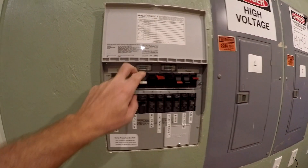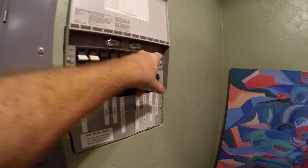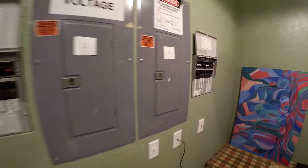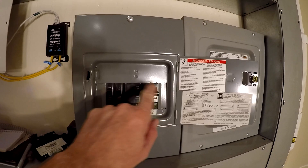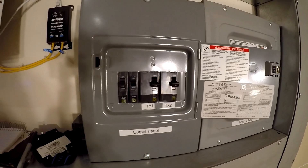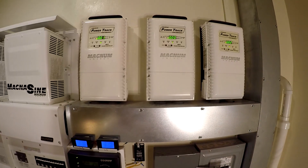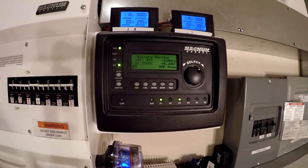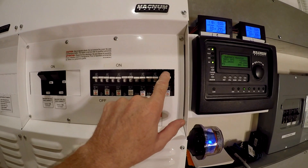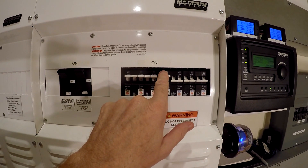Step one: I've got to turn off all the power. Actually, I'm just switching it from solar to the utility, so now the whole house is on the utility. Next I'm going to shut the system down. These are the breakers to those two panels in the other room, and this is to this room. You can see I don't have a lot of power coming in — it's just getting down to nighttime here. So these are the inputs from the solar, and these are the inputs to those charge controllers.